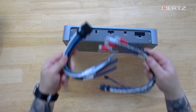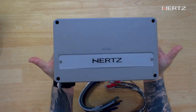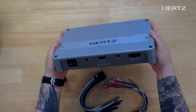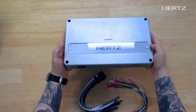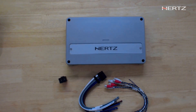This amplifier is rated at 160 watts per channel RMS into a 4-ohm load. If you show any of these channels a 2-ohm load, you can get the amplifier up to a total of 1,740 watts of total power. This is bigger power than we've offered in marine in a multi-channel configuration before, and it has been received really well by the dealers who do a lot of marine audio.